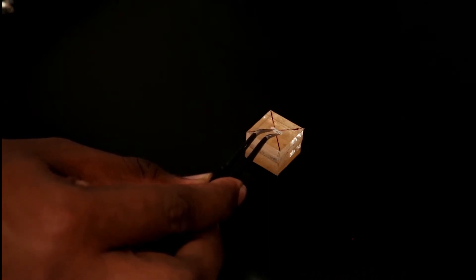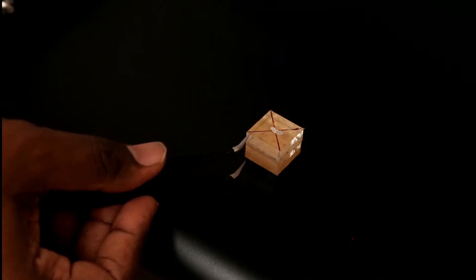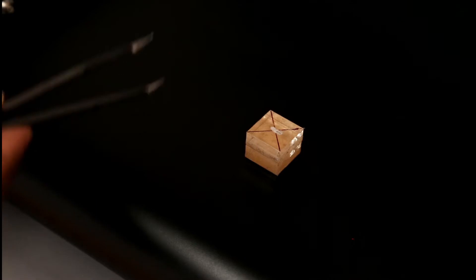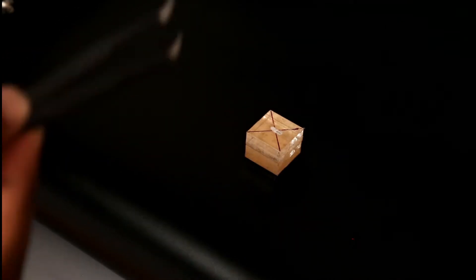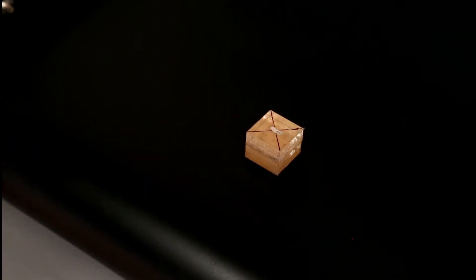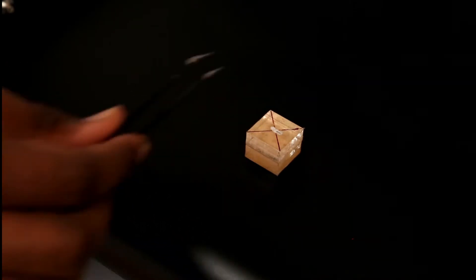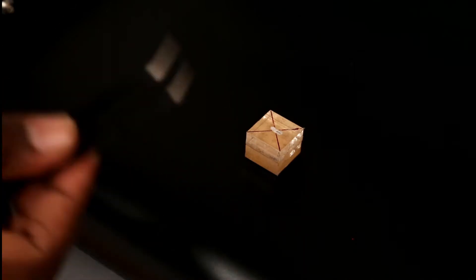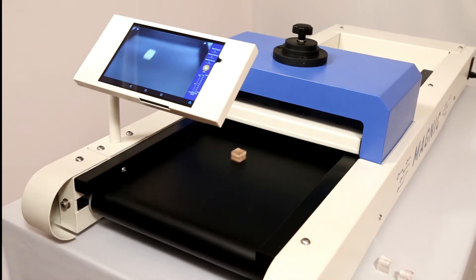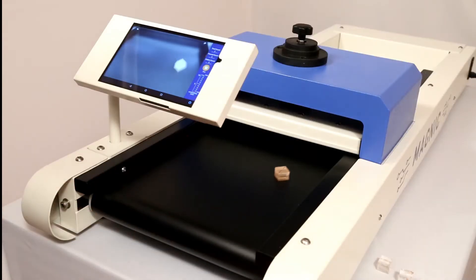We have placed this 2 mm x 0.25 mm pin at a height of 1.5 cm. The total height of the tunnel is fixed at 3 cm between the top and bottom box, so that the pin will pass at 1.5 cm, which is the poorest area of detection. We are going to pass the 2 mm x 0.25 mm pin in the worst area to ensure the machine is working fine. If it is working fine in the worst area, then it will work fine in all areas.